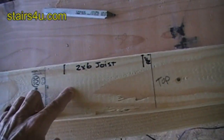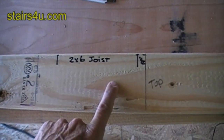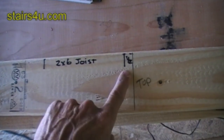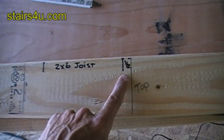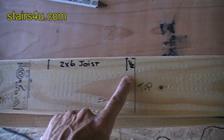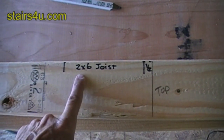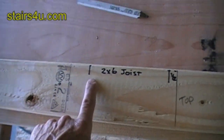Because we're going to have a floor or landing here, you can put the thickness of your decking — in this case we're using half-inch plywood as a sample. I don't ever recommend using half-inch plywood for your stair treads or any of your platforms. Then we're going to have two-by-six joists, so I marked that out here.